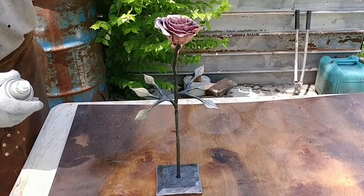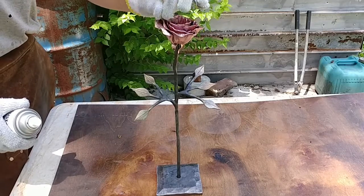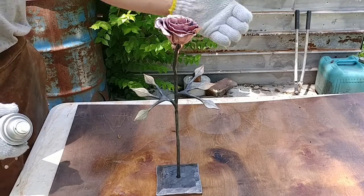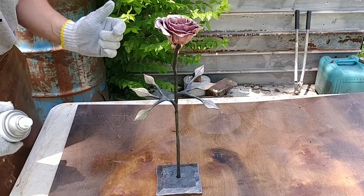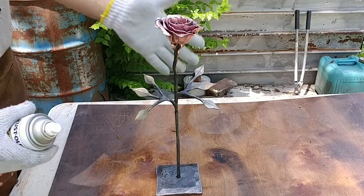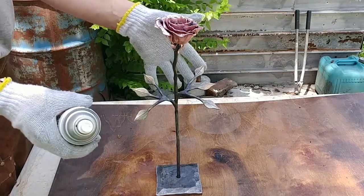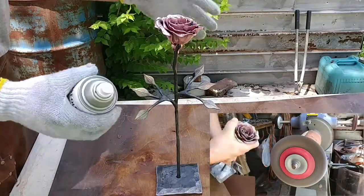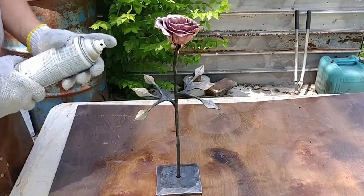The next thing I want to point out is all the colors you see here are going to darken quite a bit whenever you put a filter over them. Coating something in paint, beeswax, or oil will darken whatever surface finish you have. So you've got to keep that in mind when you're finishing work. Sometimes you'll think, oh man, I want that to be darker, that's too bright. And then when you spray paint it or you oil it up, it turns black and it's too dark, and then you've got to go back and try to lighten it up. It takes a little bit to learn when to stop once you get it to where you want it, but with enough practice you'll be able to do it just fine.